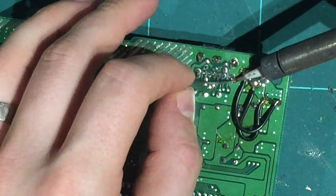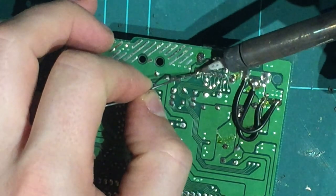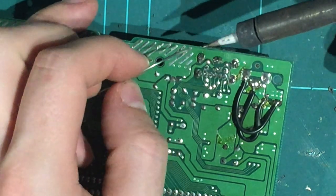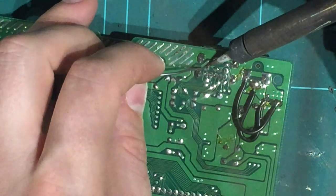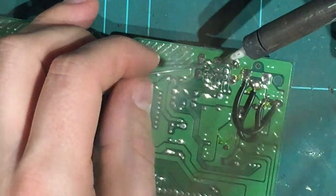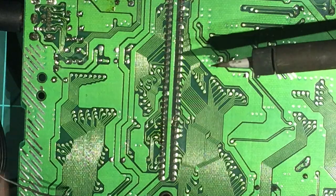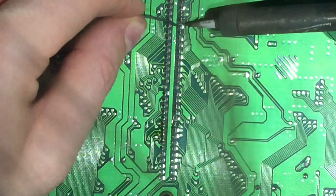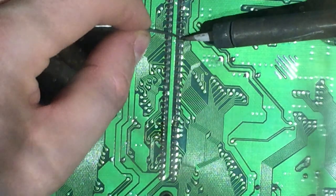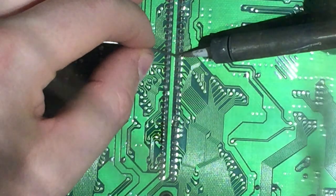Moving around to the side here. Always add a little bit of solder - it's not advisable to just remelt the old solder. You can, it's probably okay, but this new stuff has a bit of flux in the center which just helps it melt and flow. This particular pin right here is the one I'm suspicious of, so I'll flow that one. I'm also going to quickly reflow these cart slot pins and tension them from above while the soldering iron is out.